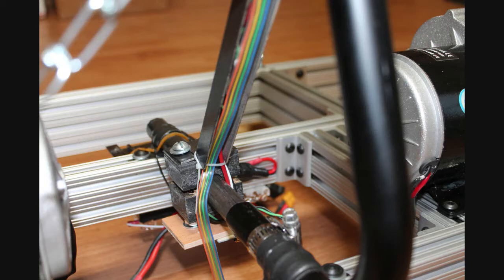The cane was unbent slightly at its handle end so that the tiller rises from the deck of the car at an angle rather than coming straight up as it ordinarily would have had it not been modified. And finally, for this application, two custom-built pipe clamps were added and a piece of aluminum channel was used to tie these blocks together. This channel serves two purposes: first, it stiffens the cane through the bend, and second, it serves as a cable raceway for the electronics that lives above the deck and on the tiller.